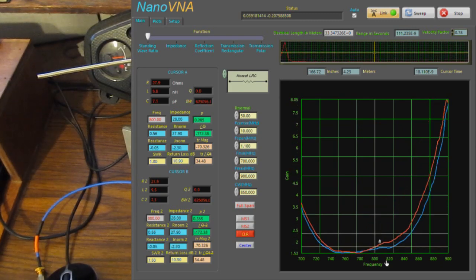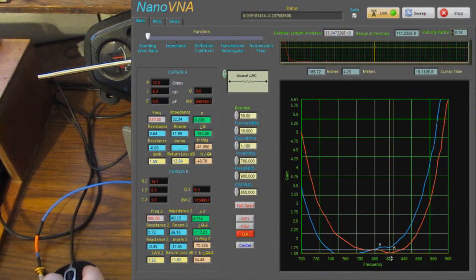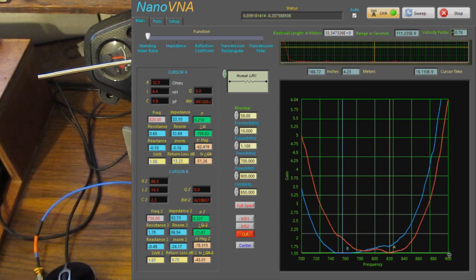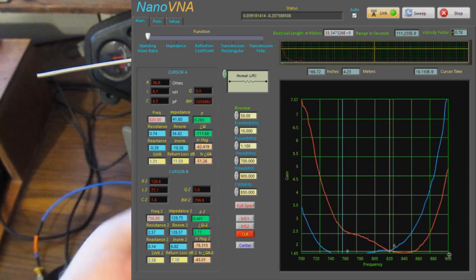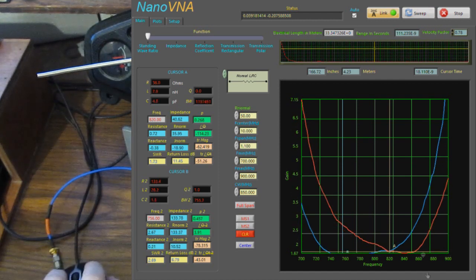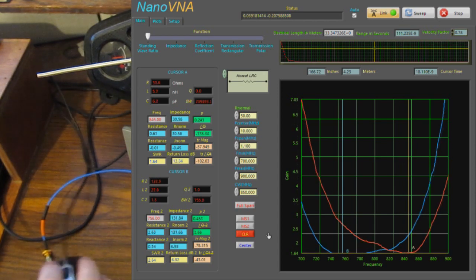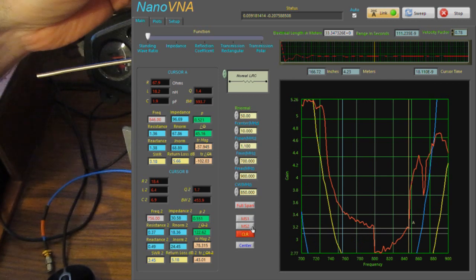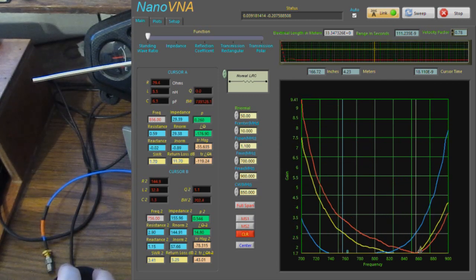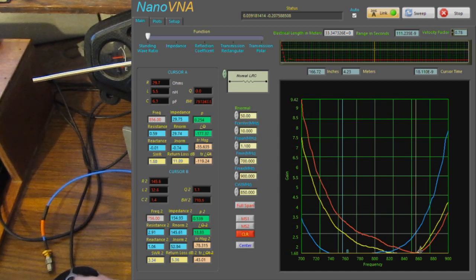What I'm going to do now is take our nippers and cut a little bit off the antenna — remove maybe a quarter of an inch. You can see how that slid the frequency over; it's now at about 820 megahertz. We'll go up a little bit higher and take another chunk off — about an eighth — and that's taking us now to about 846 megahertz. I'll select MS2 to store a second reference. Let's snip a little bit more off and we're at about 856 megahertz.